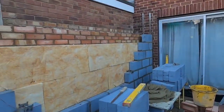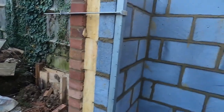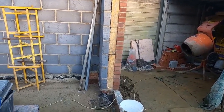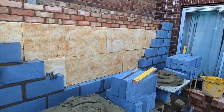It's cold — early Christmas. That weather forecast has changed from this morning. It's freezing the rest of this week — well, two days. We'll load this out tomorrow once the scaffold's up. Next week it's a no-go as well — minus one and one degrees. I can build corners, people doubt me. I've just had to shore that up — these block work corners, with the insulation, I'll just brace it. If you get a bit of frost it will force it over. Anyway, that's sound — gonna cover it up and we're going to the pub.